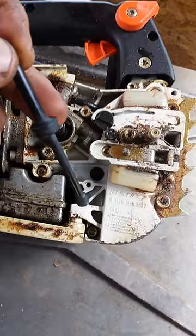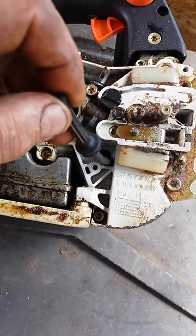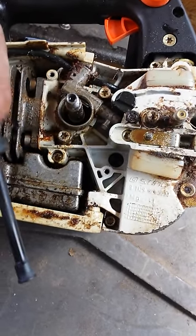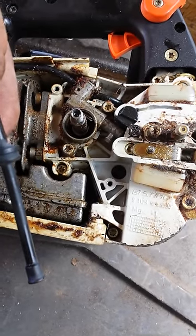If you get a new hose, put a little bead of super glue around that and reposition it in there — it will seal that leak. Although not Stihl-approved, it is Chainsaw Guy approved way to stop that leak.